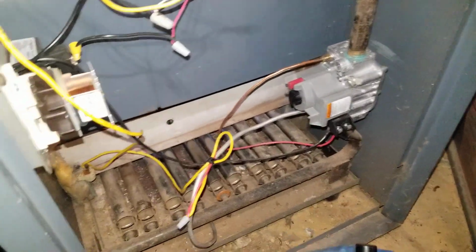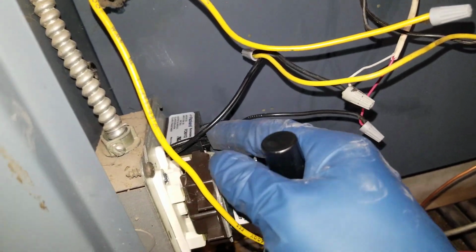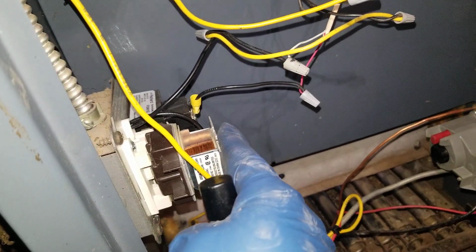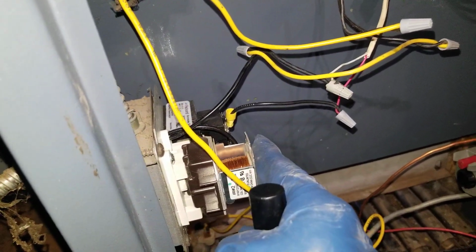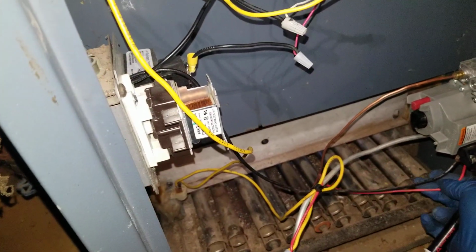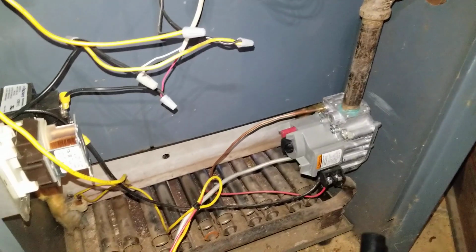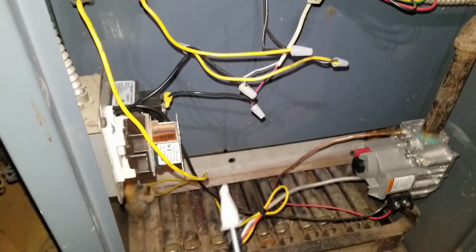So, well, the other end of the gas valve is simply connected to the 0, which is common for the 24 volts. Sometimes I call it 0, but it's a neutral basically, but in this case it's called common because it's low voltage. That's about the boiler control. We have only 4 switches in this case.